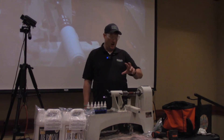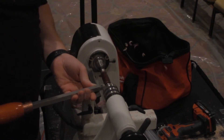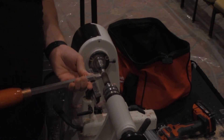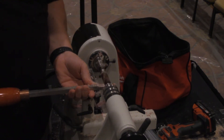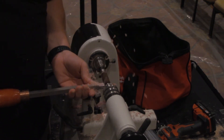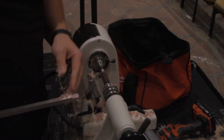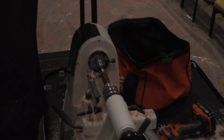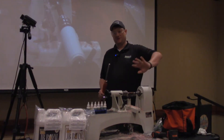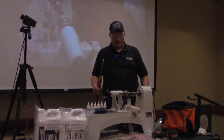The only thing I slow down for is drilling — I'll drill at about 1200 to 1600 RPM, just because it's a lot of metal slinging around and it makes me a little nervous. I tend to hog off more material than most people are comfortable with. At home I have a complete wooden shroud built over the top of my lathe with a six-inch port off the back for dust collection — it sucks everything away, about 80% goes down the chute.